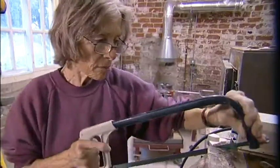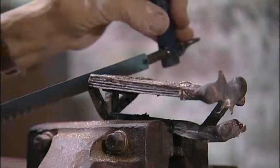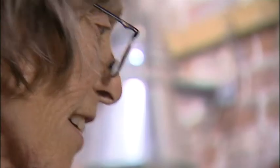And then you have your form, and with your sprues still on, those you have to cut off. If it's big, you can cut it with a little cutter on a grinder or with a hacksaw. The cleaning is just to file off the marks where you've cut, and then clean up where you've cut, and then you've got your medal.